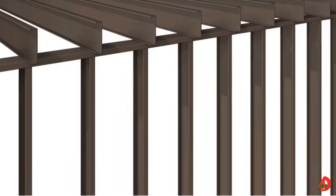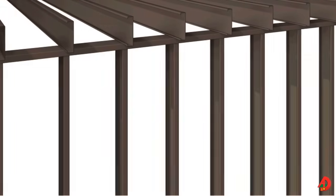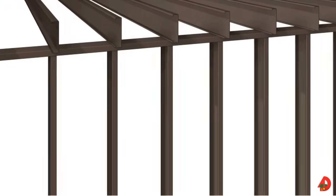Inline framing or stacking is used in metal framed buildings. Inline framing requires that all joists, studs, and roof rafters are in a direct line with one another. The reason for this is that unlike the double top plate for a wood framed building, the horizontal tracks that are the top plates for metal framed walls cannot adequately support the weight between the spans of the joists or studs. A maximum variance of 3/4 of an inch on either side of the center line is allowed.